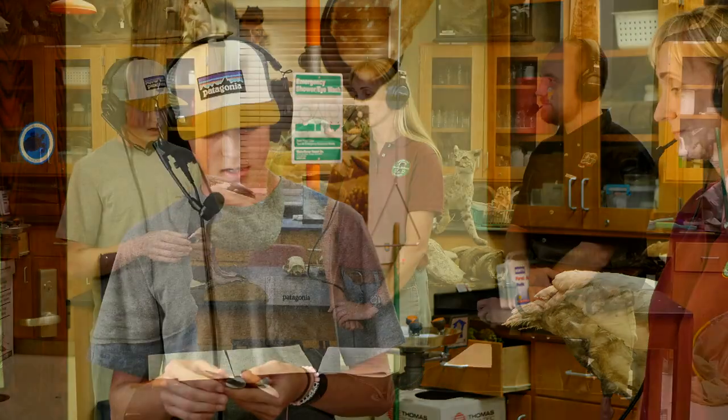And then you go for your make or break moment, which is called the quench, where you quench it into a substance. There's all different things. Sometimes water. But water makes it really hard, but water also cracks about 50% of the knives you quench in it. So I normally do oil, which is a viscous substance. Something more viscous doesn't cool it down as quick. So it's really fastly cooling it down, which is going to harden your edge, really stiff everything up.